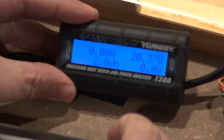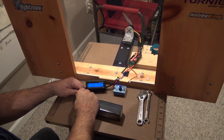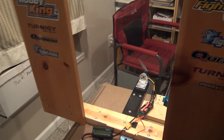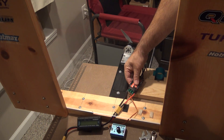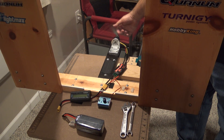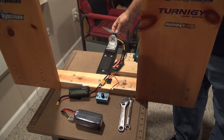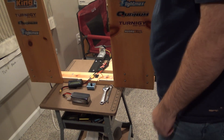Okay, let's see the numbers. It pulled a max of 83 amps, voltage dropped down to 18 volts, and that comes to 1544 watts — quite a bit. It's basically rated for 1100 continuous watts, so we're definitely running over what Cobra shows on their ratings page. Let's check how hot the motor is. It feels cold to the touch — didn't get warm at all. ESC is cold also. Frank did a pre-calculation and figured we're looking at a prop speed of about 180 miles an hour on 5S. Sounds pretty impressive!